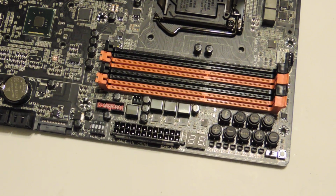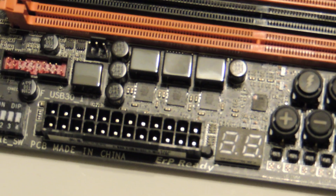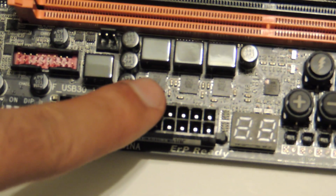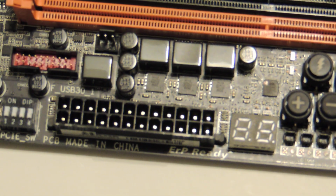Okay, so let's take a look at the memory VRM. Memory VRM is surprisingly also using IR3550. You usually don't see that because that costs a lot of money, but here we see it. They're using an IR3570 as the controller, as a PWM controller. And that's a pretty high quality controller. 3 phases are being routed directly through these IR3550s. They don't require drivers because the drivers integrate into the power stage. The 2 other phases are going to the PCH regulator.